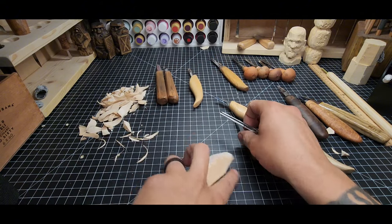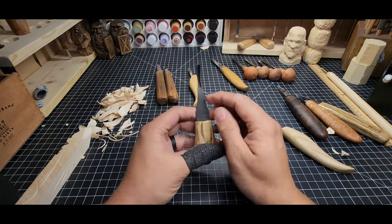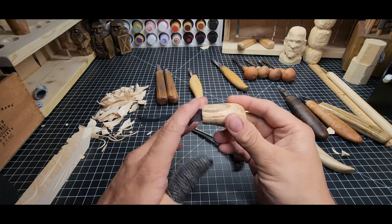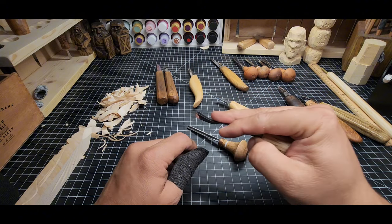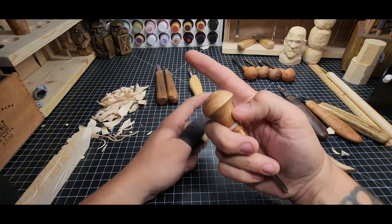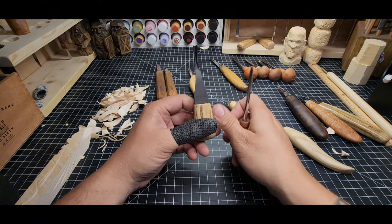If you're going to start with tools outside of just a knife, start with a V-tool and a gouge — about a number eight. FlexCut makes great V-tools. This one is a palm tool — you don't want the larger tools with massive handles. A palm tool you can easily keep in hand and push or pull into whatever you're carving; that's much easier to manage. Go for a U-gouge at about number eight and a 60- to 70-degree V-tool and you'll be all set.